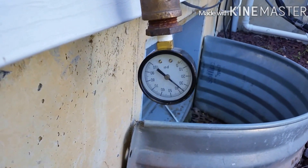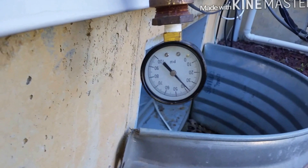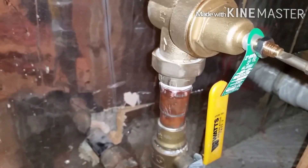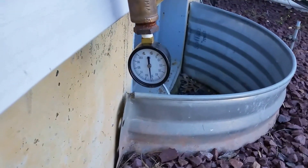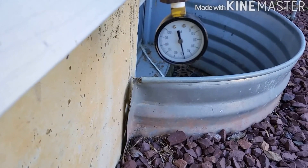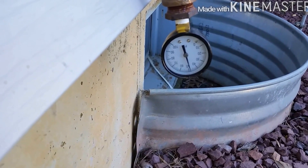Can you turn off the kitchen? When the toilet shuts off, I'll boost it up some. Factory set at 50 but I'm reading about 45, so I'll adjust it clockwise to increase. You have to loosen this lock nut, then go clockwise. I'll go one full rotation and then go outside and check it again and adjust as needed. Now reading about 55, drops to around 52 with the faucet. Go ahead and flush — around 48 flushed. That's pretty good.